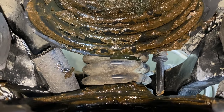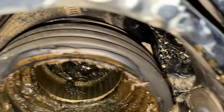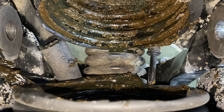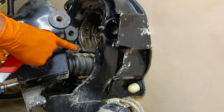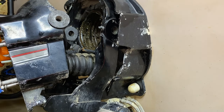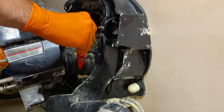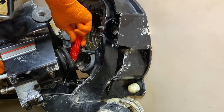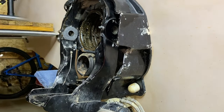You may want to just cut from the get-go without loosening the clamps, but we owed it to you to show where the clamps and screws are. For Alpha 1 Gen 1 owners, remember that little access hole for the exhaust bellow screw. We're going to cut the lower exhaust bellow with the utility knife. Pull out and shift the bell housing to port side — our shift cable is already broken, which is fine since we're replacing it. One less thing to snip. Pull this out and make the cut.